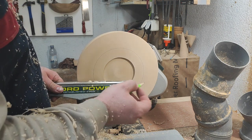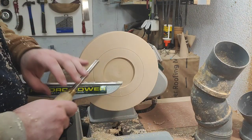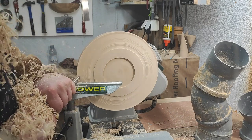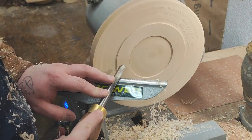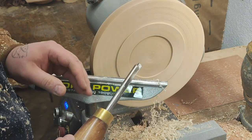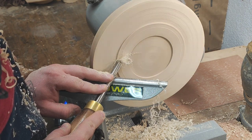The foot - let's say roughly around there. I want to set that in, so spin those out. This is a major grind bowl gouge, Raffen style. From the middle of the bottom of the flute to the right it acts like a traditional grind, and if I get it right it should be a nice clean cut. I think I'll need to sharpen it, but let's go first without sharpening.